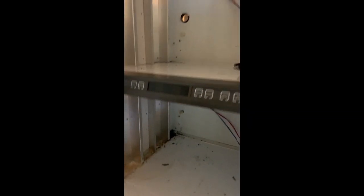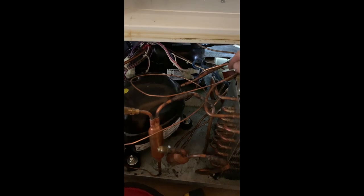The interior is pretty much stripped. The front compressor of the mechanical shelf is for your upper system — it runs a heat exchanger. There's a copper line that runs in a circle; it comes around the side and ends up being screwed into the ceiling right there — just a Phillips head screw. Remove that screw and it will drop down a three-way connection. That T-connection branches off to each heat exchanger. We're going to replace behind that T. We know there is no leak in front of it — we have tested it with nitrogen.